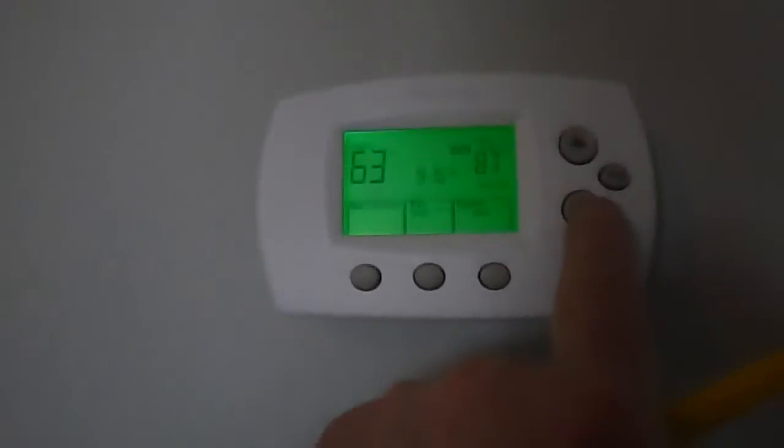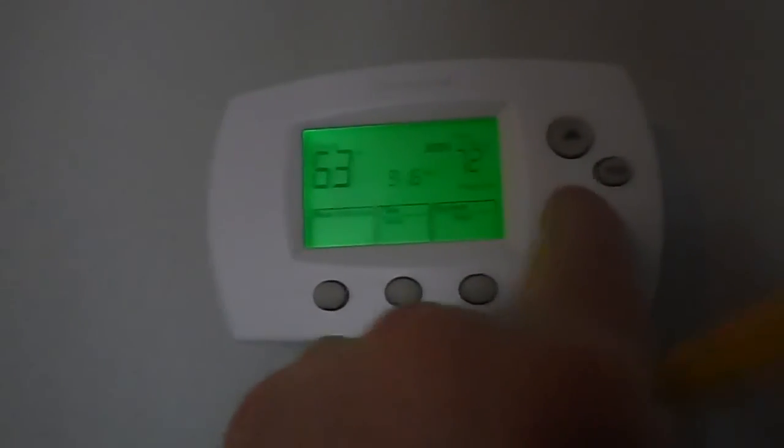We're in the master bedroom — another ceiling fan, thermostat here. I ran the air conditioner and the heater; both are working fine. However, you should not have a thermostat inside a bedroom. If you close this door, the thermostat makes this room perfect while everybody else may be miserable because it doesn't sense conditions outside the room.